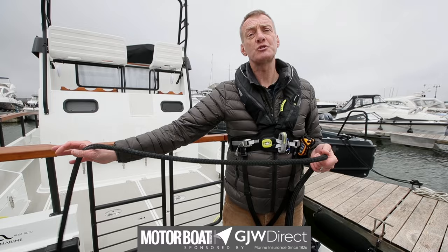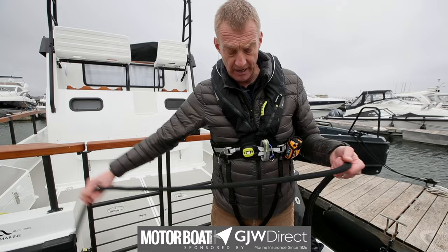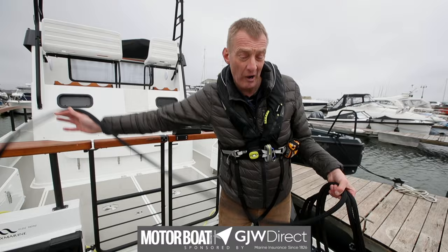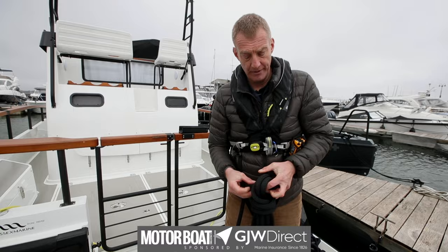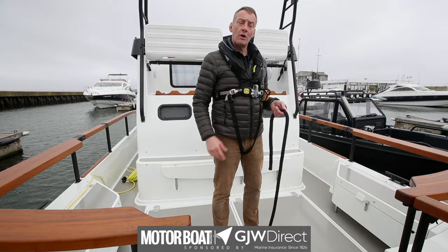This variety is what's called braid-on-braid and it's brilliant for mooring because it's got a much harder outer that wears better, so if there's any chafe it handles it much better than three-strand. You can get it in two varieties: sailors buy it for halyards, which mustn't have any stretch, but we want the mooring variety which does have stretch, so make sure you talk to your rope supplier and get the right sort. To coil it, it's exactly the same process — the little twist at the top is not quite so important, but use the same technique and you'll get the same effect. Same technique to finish: little twist across, use up any extra, then pop a little loop through and either drop it in a locker or tie it up.